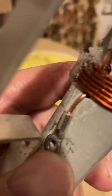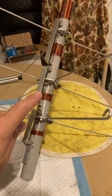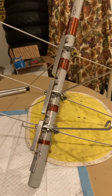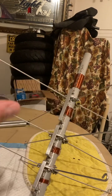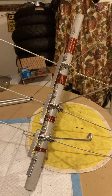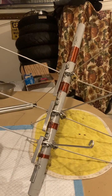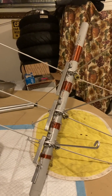Look at the solder joint on that — no solder on the top, not crimped. So what I did today: I took the capacitance hats off, took the biggest pipes I had, put it on the tilt base, tilted it down, took it all apart, put the bigger pipes in, tightened the clamps on the pipes, ran it up, tilted the antenna back up, and put the pin back in.